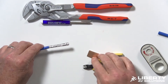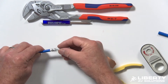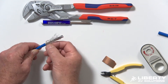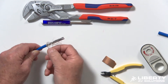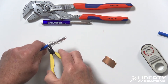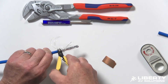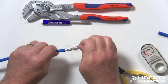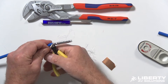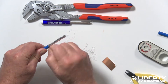This cable is going to have two different shields on it. You have a braid shield, and each pair is foil shielded. You want to go ahead and do a birdcage with your braid shield and then pull some strands off to the side — this will be your drain wire. Then go ahead and trim around the edges with your flush cutters, flush against the jacket. Get as many strands as you can without cutting off your drain wire.